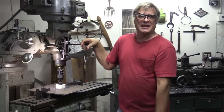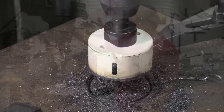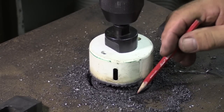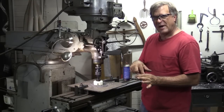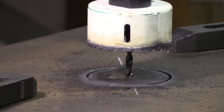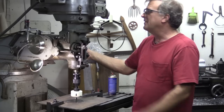You heard all that noise — it was cutting and working great. I was putting cutting oil in it, and now all of a sudden it stopped making noise. What happened is the kerf has gotten deep enough where every time I'd bring the hole saw back out it would bring some chips with it. Now the kerf is deep enough that the chips are staying in the bottom, so as the saw turns and tries to cut, all those chips stuck in the bottom of the kerf are acting like little ball bearings, just rolling around keeping the teeth from going all the way down. So back it off, get the air hose — poof poof. You should always be wearing your safety glasses; closing your eyes doesn't really help, so put glasses or a face shield on.